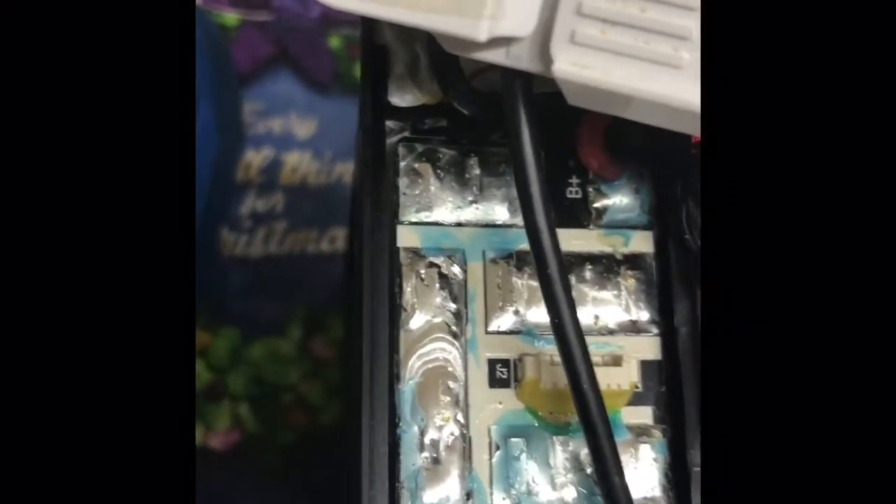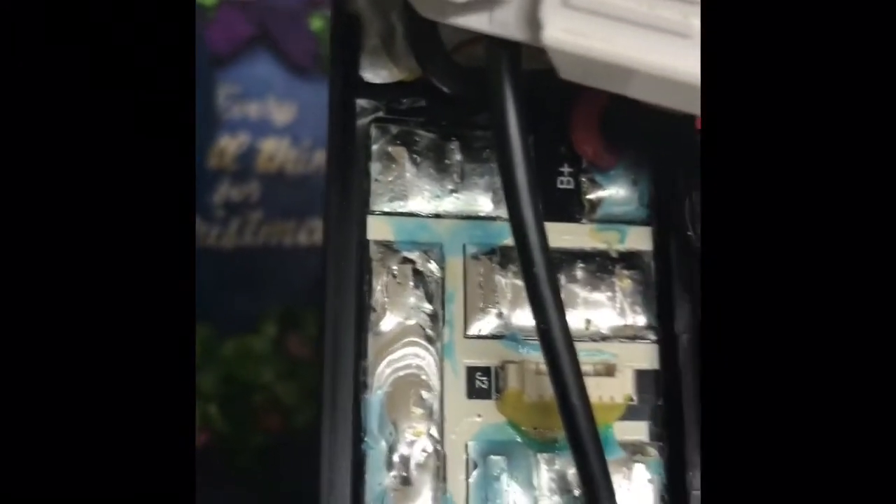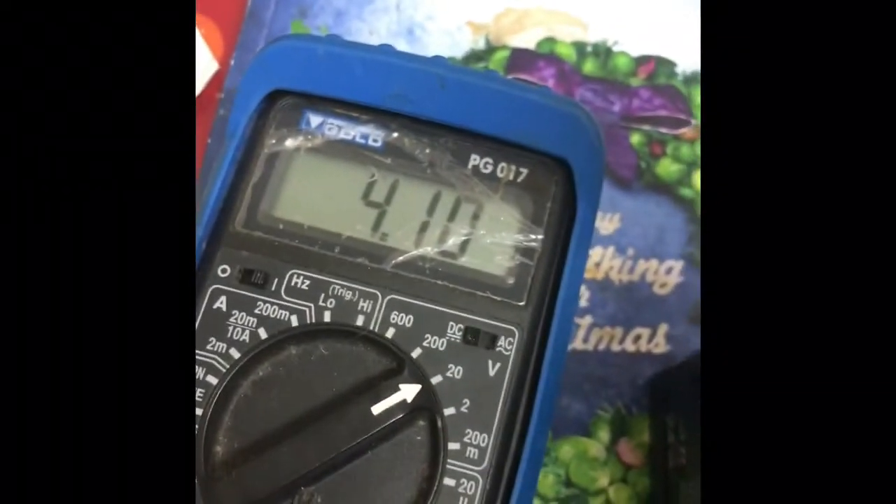To prevent this, most people would just wait an hour or so for the battery to cool down and then charge. But in extreme cold weather, discharging your batteries while flying can cause temperature differences. DJI have recommended heating your batteries to 15 degrees Celsius so that the cells would discharge uniformly.